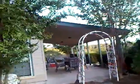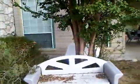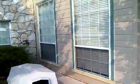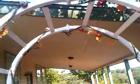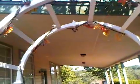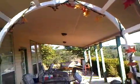Coming back to the rear right of the home, we've got some fascia back here that we have to address. It comes all the way down behind this tree and then extends out into that huge rear porch cover. On this wall directly facing me, this has not been done in hardy, so this will be part of our scope of work, including those two large windows re-trimmed in hardy as well. This entire wall will be done in the colonial rough sawn hardy, as well as the extending fascia all the way down here to the patio cover. We're not painting the underside of the patio cover — we're going to leave that alone. The soffit and patio cover are in good shape, so there's really no immediate need to address that currently.